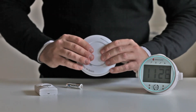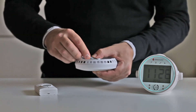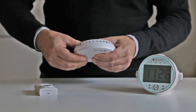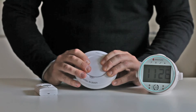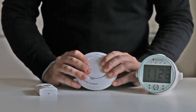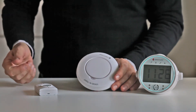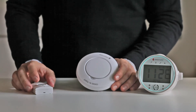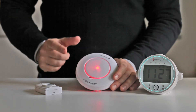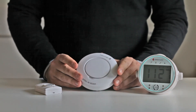That tick sound indicates that the smoke alarm has now been discharged and is ready for a new pairing. Now I hold down the test button, and at the same time I put back the battery, and I wait for the smoke alarm LED to start blinking slowly. Now it starts to blink, I release it, and now I can see a quick blinking. Now it's ready and listening to all the other transmitters. I push any of the other transmitters, and now it has listened, and I confirm by pressing the test button once again.